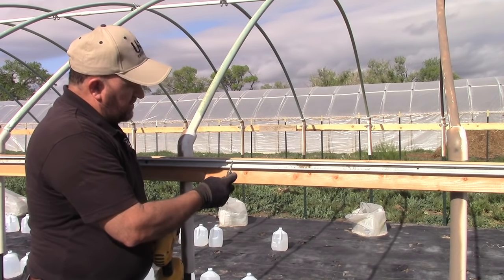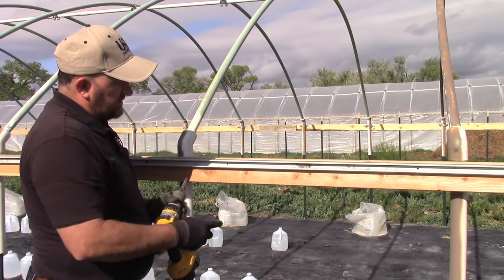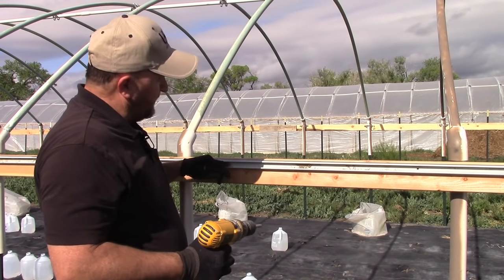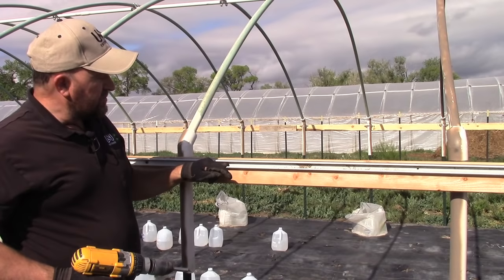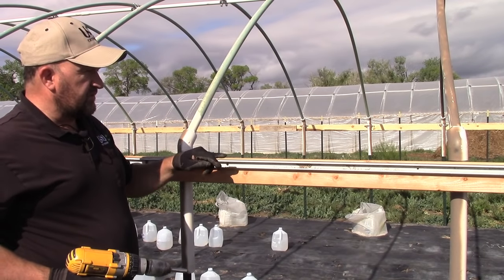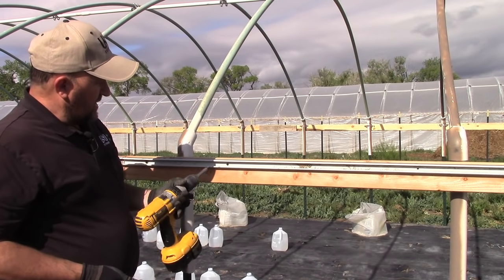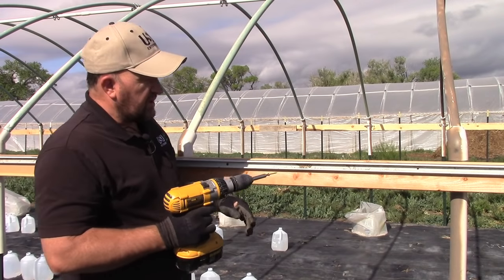To drill the holes, I just put the self-tapping screw into a nut driver, attached it to my drill, and drove it through — drilled the hole in the wiggle wire track. Doesn't take too long. Take your screw — self-tapping or the grabber screws — and just screw them into the wiggle wire track. If I don't have these spaced close enough, the wind can actually bust the heads off, so you need to have your spacing on these grabber screws at twelve to maybe sixteen inches or so. You don't want only three or four of them in an eight-foot wiggle wire track — space them a lot closer for more strength. The self-tapping screws are a lot stronger; I've never had those break off, but the grabber screw heads can pop off, so make sure they're close enough that they don't break off in the wind.